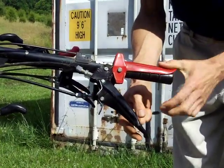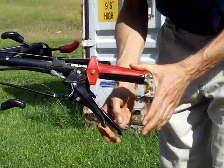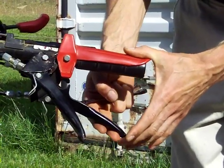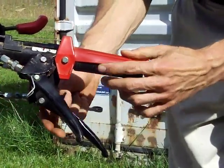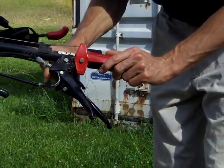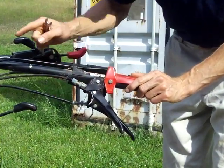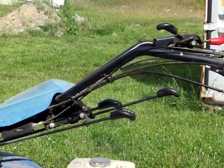The distance from the point of the end of the clutch lever up to the handlebar when resistance is encountered in the squeeze should be about four to five inches and not more than that. Now, if you run out of clutch adjustment here — if you get all the way out to the end of this bolt and you still need more adjustment — then you can go to the bottom of the clutch cable down by the engine and reset the cable there.